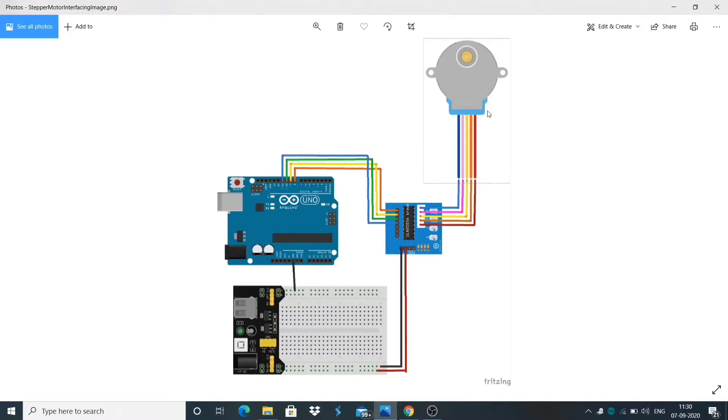The result is a motor that spins at 2048 steps per rotation. The motor usually comes with a ULN2003-based driver board. The ULN2003 is one of the most common motor driver ICs, consisting of a 7-array Darlington transistor pairs. Each pair is capable of driving loads of up to 500 mA and 50V. 4 out of 7 pairs are used on this board.